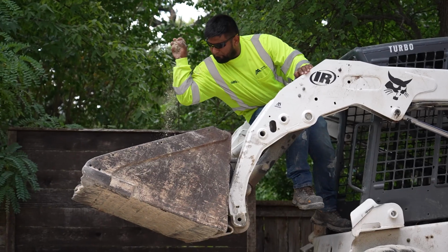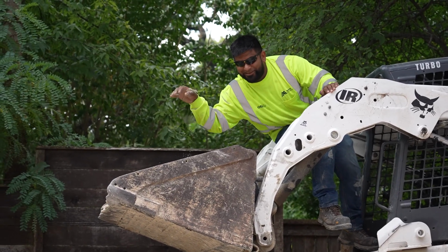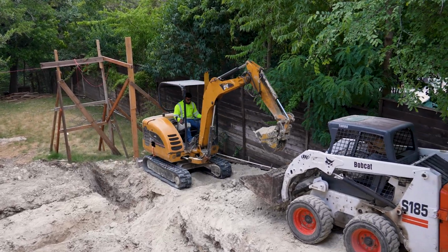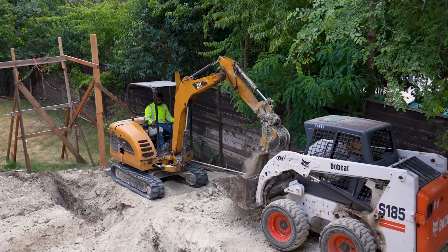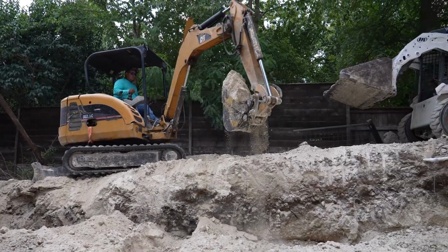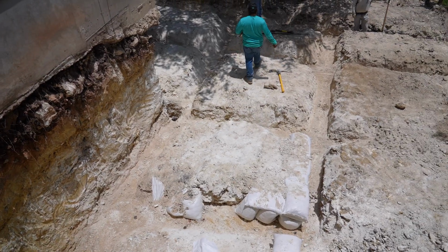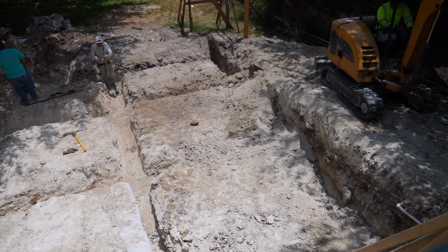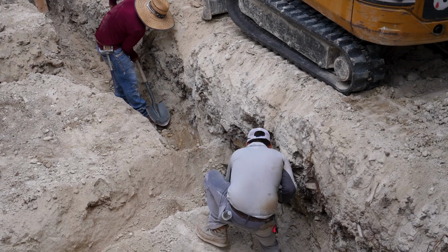I don't care what environment you're in. If you're in the middle of the country and there's no permits, the stakes aren't as high, but still, you want to just make sure that you're building exactly to your plan. But in an inner city setting, this is paramount. If for some reason you poured your foundation outside of an area that you were allotted into what's called the setback where we can't build, or let's say in an erosion hazard zone or in a septic field, then the city can actually make you tear all of that out and start back over. That would be a disaster.